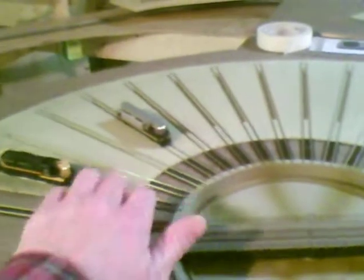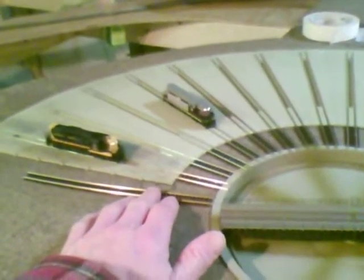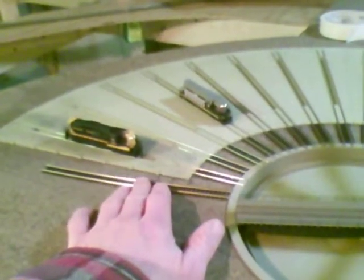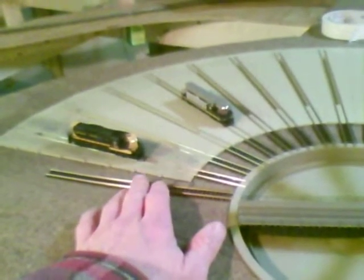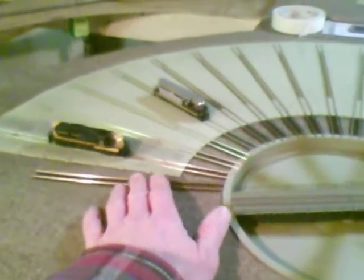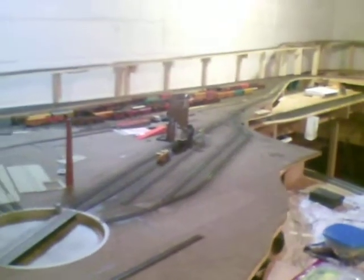As you can tell, I do have decoders inside these two engines, one's a GP7, one's a GP9. They are wired up, I've got to do a little bit more work to them, they kind of cut out every so often, and I think that's just with the connections on the trucks themselves. So we'll go ahead and do some more work on those, get those ones up and running. Hopefully I can go and get some more decoders and get some more engines up and running and get this turntable area here done, and get a couple block occupancy detectors put in. Or I'll do some more how-to videos on some of the wiring and what I'm doing with everything.